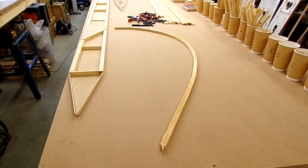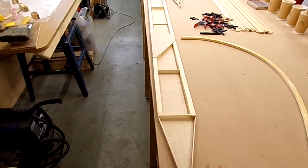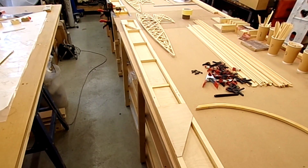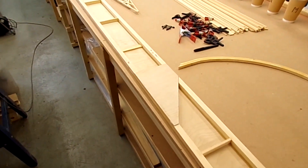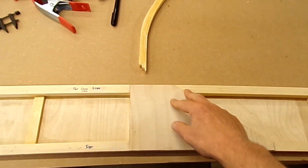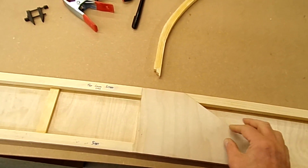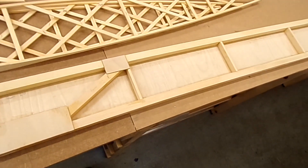So this week we've got a fair bit done. I laminated up a wingtip bow, and we've got the starboard lower forward spar I'd say three-quarters built — one could argue 90% of the woodwork is done on it, but there's still more work needed. I've got to route out these holes and I've put plywood on both sides to step up for the metalwork. I'll need to drill holes and put bushings in. And similar for the bushings for the metalwork at the other end — so that's one spar done.